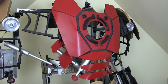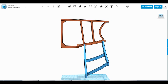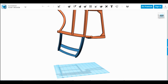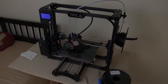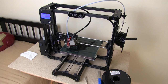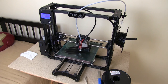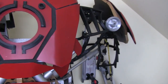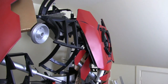Here is the next part which tacks on the bottom — in blue, with the previous part in red — made out of four pieces that will be acetone welded. From the very bottom we'll have a piece down to cover the base end of the piston. I've separated those onto the flat bed for printing. We'll do one side, stick it together, then make the mirror. This part will probably take about an hour and a half for all four pieces. I've now fitted those pieces on both sides — one here and one over here.